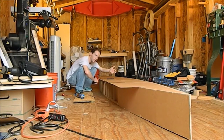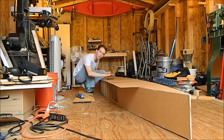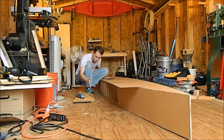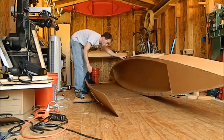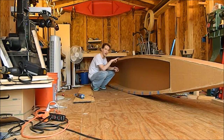First thing I'm going to do is tip this up on its edge and put some chocks underneath it to keep it from tipping, because I need gravity in my favor to get clamping pressure on this wall piece. If I set it flat, I'd have to come up with ways to apply sideways pressure over a 16-foot length and I just don't have any way to do that. So I'm going to use gravity. I also need to trim the side down just a little — I left it about an inch and a half too long — so I'm going to center it up and trim each end so that it matches the bow and stern wall sections.